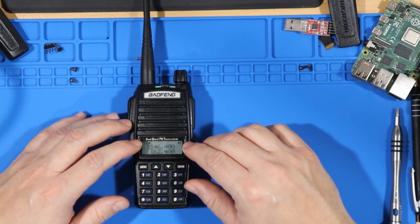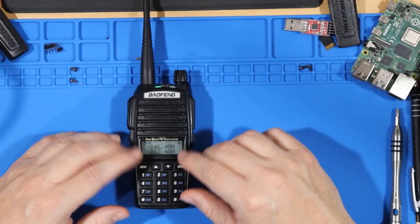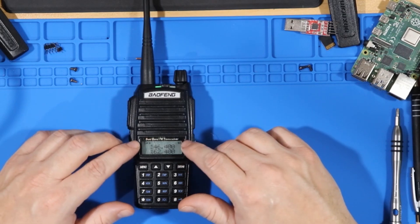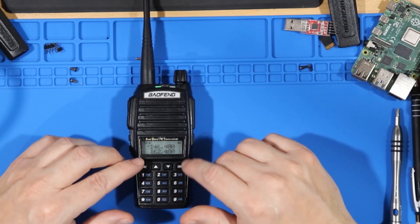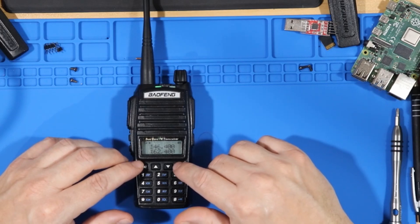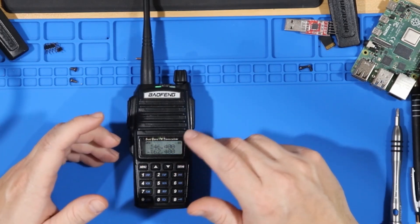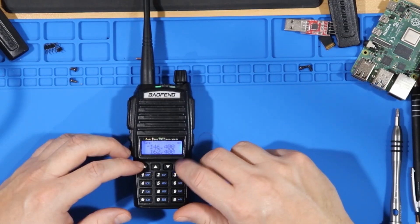This comes into play when trying to work with satellites — when you're trying to transmit on the two-meter side and then receive on a 440 signal. You want to transmit and then jump to the B side so you can hear, but with squelch disabled, it's not going to do that jump for you. You will have to hit the tab button to switch to the other side, and that takes a second, so you might miss someone coming back to you.